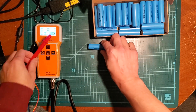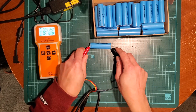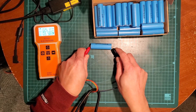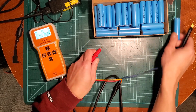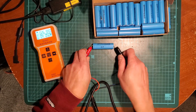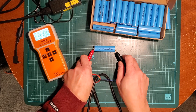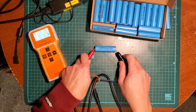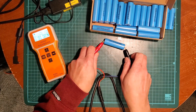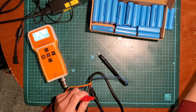I'm going to test a random bunch on the resistance meter. I got 26 milliohms at 3.58 volts. Another: 26 milliohms at 4.05 volts. And another: 26 milliohms at 3.65 volts. Voltages are just random as you can see, slightly different but not a huge amount — 3.64 volts, 25 milliohms. They all pretty much tested like that.